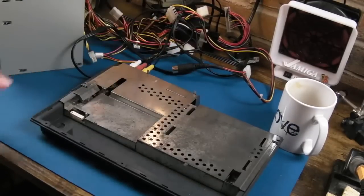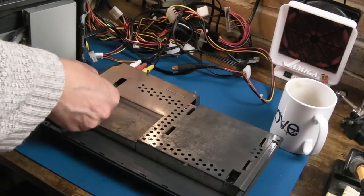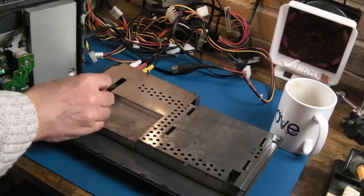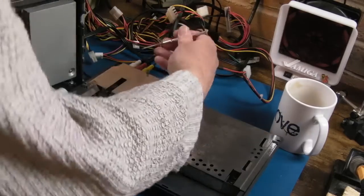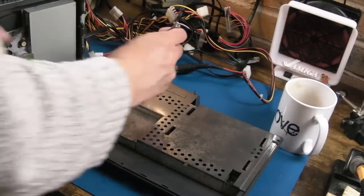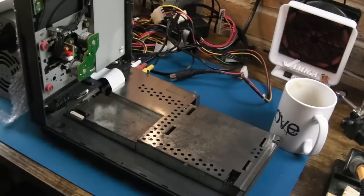Yeah, that wasn't on quite on there, that's it. So yeah, my shielding is a wee bit rusted and stuff compared to some of the units out there. So finishing up here with a bit that I absolutely hate, and that's lifting this flat flex. Why did they not create the shield a little bit bigger gap here? It really bugs me, this thing. You lift it up on one side like that, and then try and hook onto the other side. Yeah, that's coming up, but then that side's gone down, seesawing now. It's just near impossible, it seriously is.